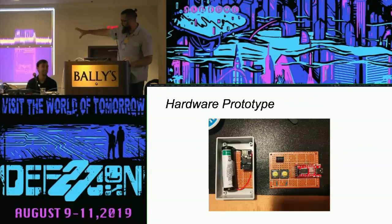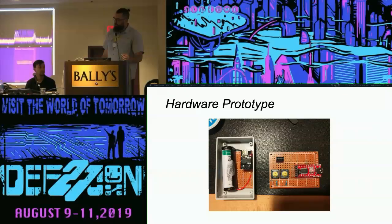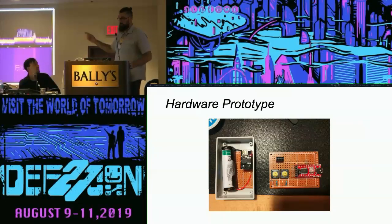We went from the development board to our deployables on the left. We upgraded from the nickel cell to lithium-ion batteries — a 3.3-volt, roughly 1200 mAh — and those lasted us about two hours. We used a utility case you might install at your house. We found with all the heat generated, this wasn't a great idea because there's no way to ventilate the heat — the plastic got really hot. The last thing we wanted was to cause another fire at DEF CON. And they were a little big.